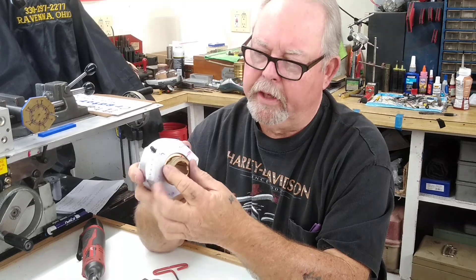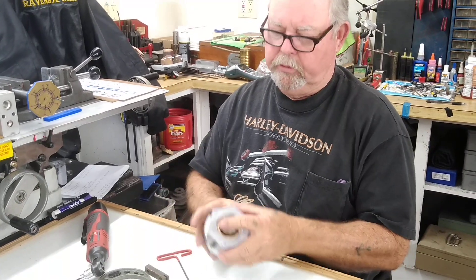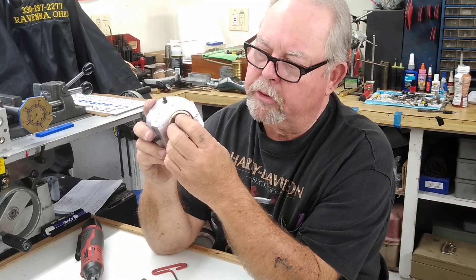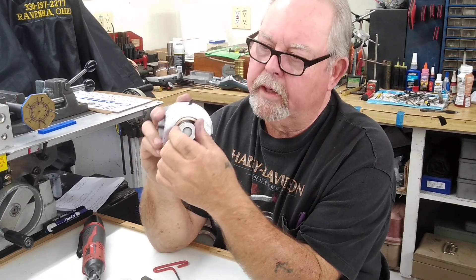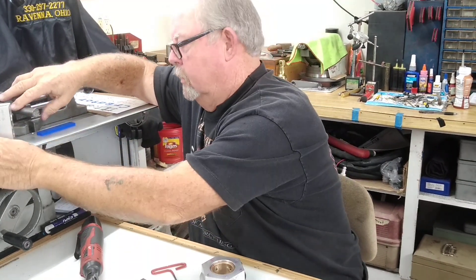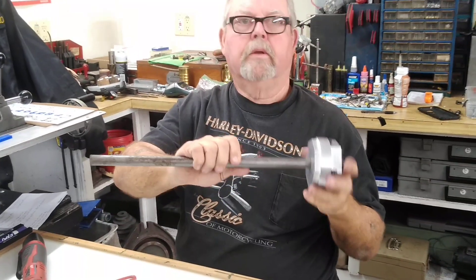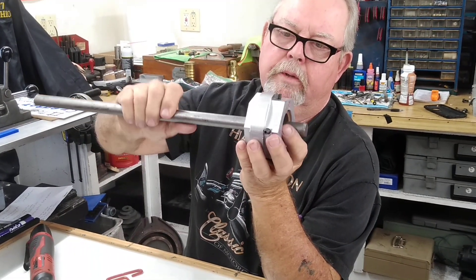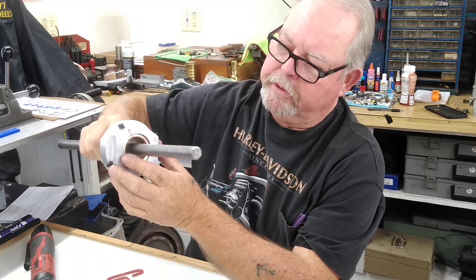Now you can clamp this down, and without the bushing you can put the one-inch stock in here. I was going to make a bushing for it but I found I didn't need another bushing — I can just set this and then sweep with very little effort. We can get down even into a three-quarter. This is a three-quarter cold-roll, and I'm about one-and-a-half thou over. If I get into a piece that's warped, that's all you need.